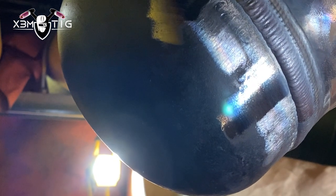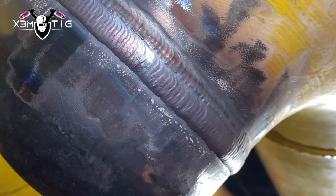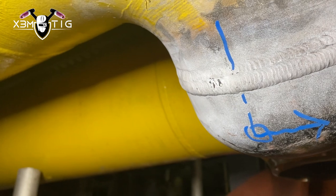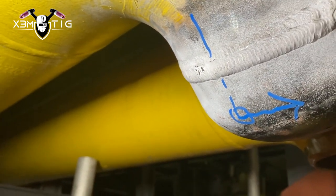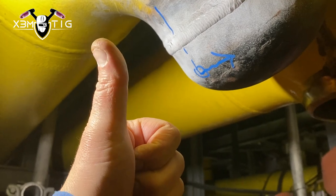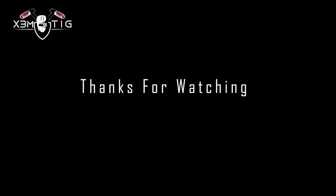Now going up to 10 o'clock — that's where I'm going to stop and connect to the top part I already did with the downhill capping. From the bottom I'm just connecting up. This is the final cap, final pass. I'm really satisfied with how it turned out, and so is my QC — it looks good for a difficult and really demanding weld. The x-ray results were good, everything is okay. Thank you guys for watching and for your support — take care and see you in the next one.